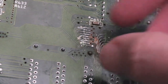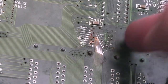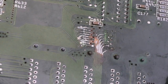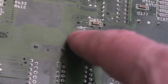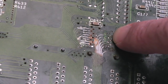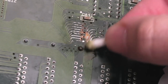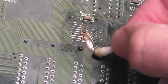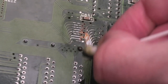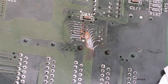Because you see the chip profile, you would be able to align it with those, and as long as you cut every other pin short, you would be able to solder it on the other side to those wires. I mean, I could still do that. I might have to put some fixed wires on this side to these wires, but it looks like the wires are actually shot here as well, so I don't know, it's a nightmare this. Actually, all is not lost here, and I think what might have been done, and what I may do myself, is mount the chip on the underside, because the pads and traces and things here aren't that bad, actually.